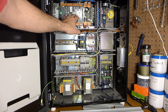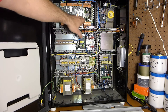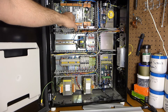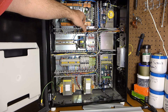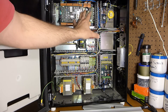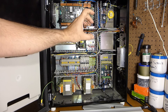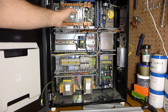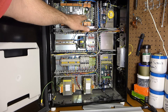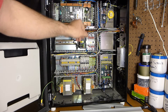The only real troublesome thing is spindle control because this board down here is not an isolated board — it's got high voltage all over it. Back here on this rear panel, I think there's an opto-isolation circuit where a 5-volt PWM input goes into this board, and then an isolated section converts that to a 10-volt output for spindle speed. If I go to a different controller, it's probably not going to have a 0-10 volt isolated output, so I'll either need a breakout board for that signal or tap into this board and reuse that circuit. The plan is to go to a different control board and possibly put a bigger 24-volt power supply in to power new stepper drivers.